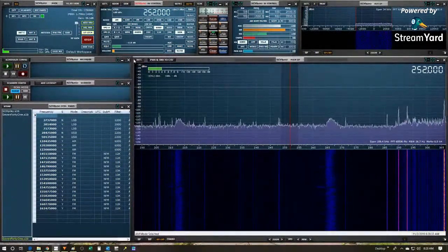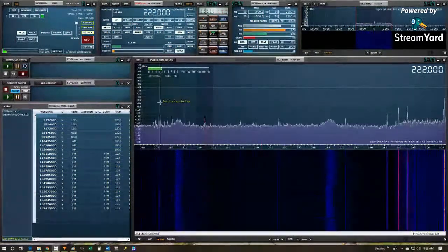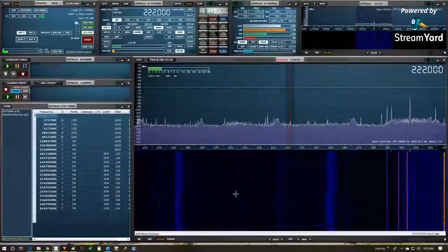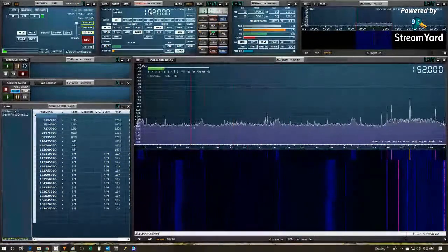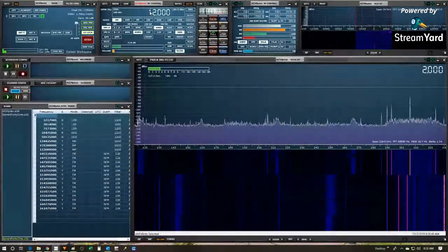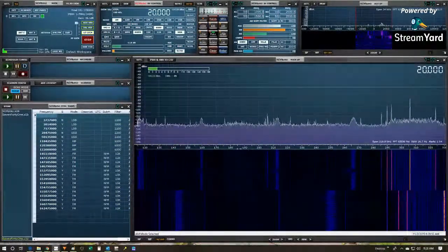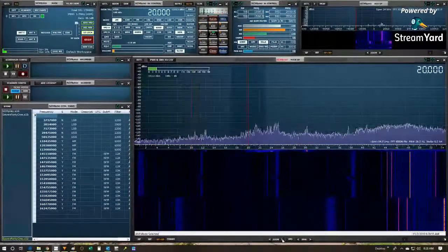Yeah, on my Duo with that high Z input port, I've never used that because most of my antennas come in on coax, so it's 50 ohms. So to me, that's kind of a wasted port, and I like the fact that they've now changed that over to 50 ohms.